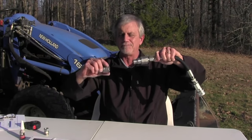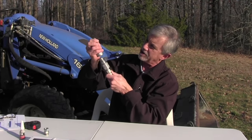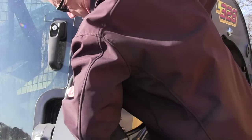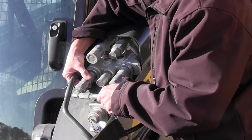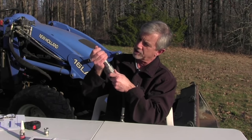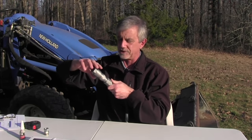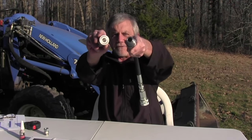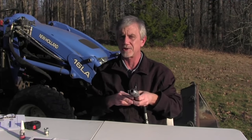The advantage of flat face couplers — this is what you see on skid loaders now. A lot of times the fittings are right there and you just push in and it locks. To unlock it you just pull the collar back. As long as there's no pressure, this is actually easier to hook up because you're just pushing and it locks in. There's no mess — it might leak out a minuscule amount, but with the flat face you can just wipe off the ends. It's a lot cleaner, a better system, and it flows more.